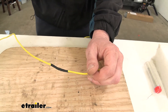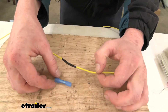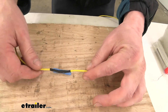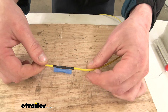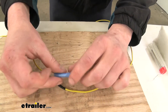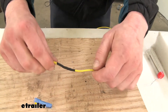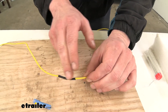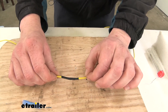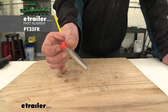You can see here that with this repair it's a much cleaner look than with a butt connector. Butt connectors take up a lot more space, so if you're making a repair in tight locations or feeding wires through openings like grommets, you can see how much cleaner this repair is. A butt connector in most situations will get the job done, but if you want something that's going to last longer that you'll never have to worry about, with lower resistance — which can be important depending on the circuit — then this is the better route to go. And that completes our look at Performance Tools 0.031 diameter rosin core solder.